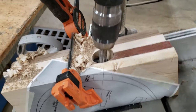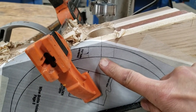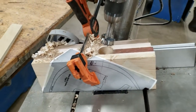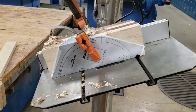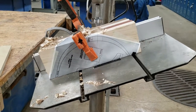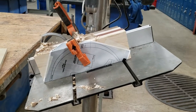I don't have to drill all the way through — that's how far I drilled. I really only need to drill past that line because I'm just cutting this part out; all the remainder is waste. When you drill your board, make sure you have your board wide enough to drill it straight. If not, you have to drill it on this horrible angle — it's a lot more setup, a lot more work.